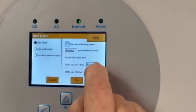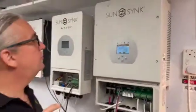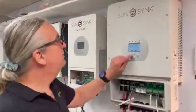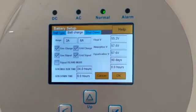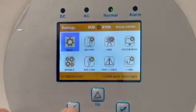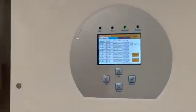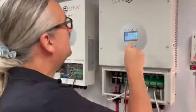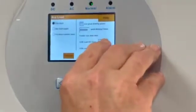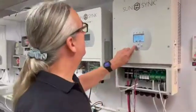Looking at our settings under auxiliary load: generator off at 54.6 volts, generator on at 48 volts. The generator-on voltage is very important. Battery charge current has been limited to a couple of amps for this experiment. On the system mode, I've set the off voltage at 50 volts — don't mix these up. The auxiliary shows an off voltage of 54, but using the controller will override that voltage.